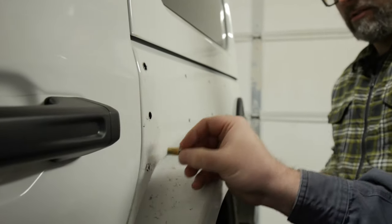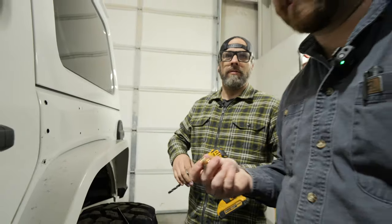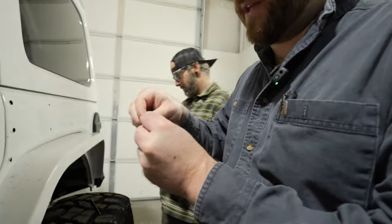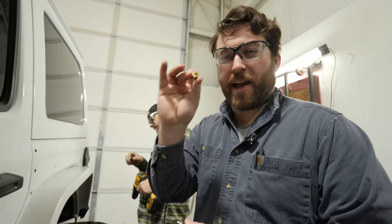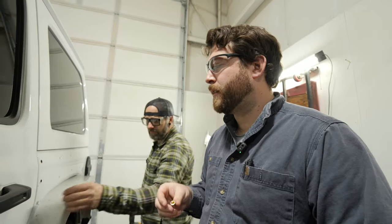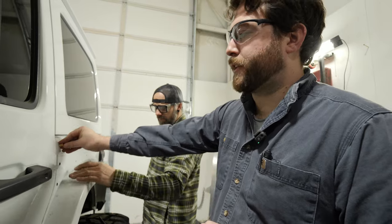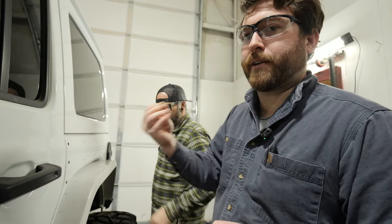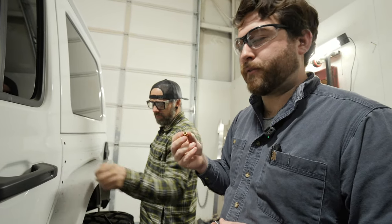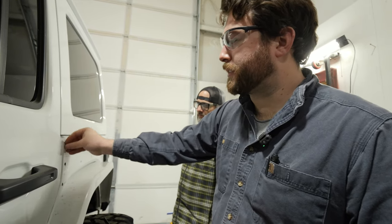That's a really nice tight fit — let's go up to a 25/64. We don't manufacture these rivet nuts in-house, we buy from suppliers, and occasionally a batch will have a little bit of variance in size. Before drilling all of them out, we started by test-fitting the first one, found it was a little too tight, and bumped it up that extra 64th of an inch.